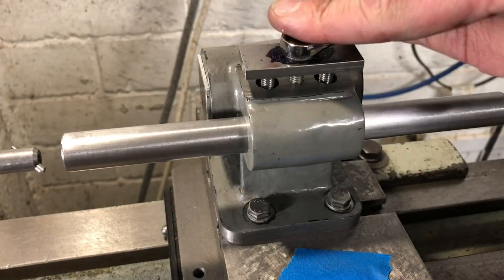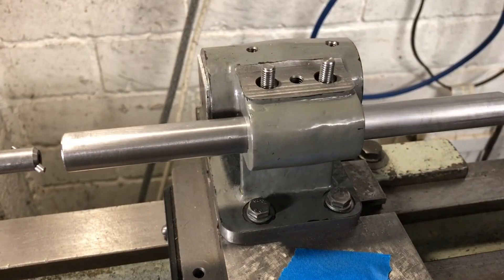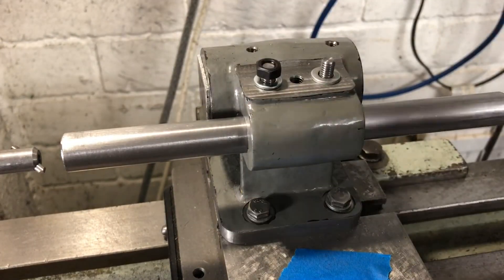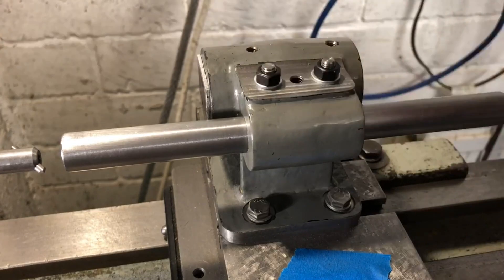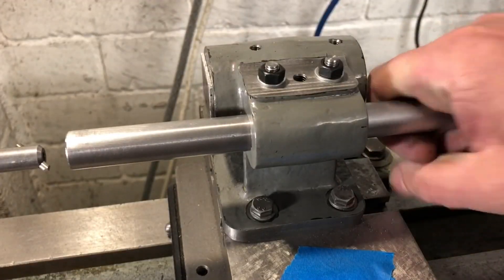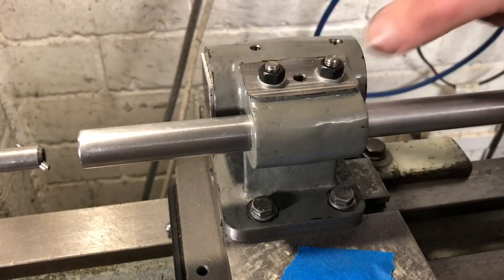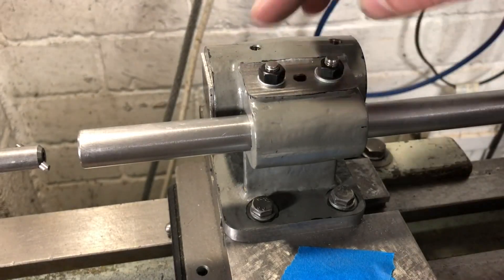The tapped hole left in the top of the casting is no longer needed, and it will eventually be capped off with a grub screw. Before we go any further, I'll just pull up those cotters with a couple of M6 nuts and washers to check they work alright. That is something that irritates me a little bit about this project — all of the dimensions are in Imperial, as per the original plans by Thomas, but the hardware has been replaced with the metric equivalent. I have nothing against metric fasteners, but mixing the systems in the same project is just a little bit unpleasant. So those cotters have secured the bar really nicely. I'm also a little disappointed that those two threads are at different heights — this could be down to odd washers, but either way I will need to trim those down or they will smile at me forever.